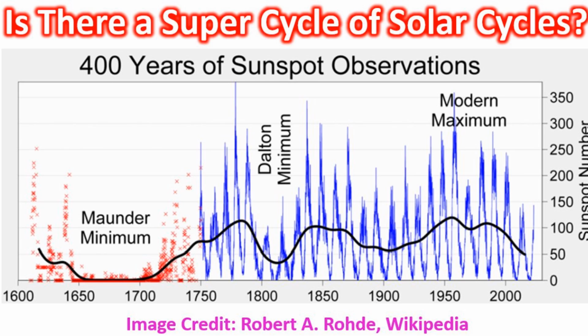Though 807 tubes were fully rated for up to 60 MHz, as my home Philips Prestige radio, which I had used as RX, did not have the 20 meter band, I had operated mostly on 40 meter. When the solar cycle went down and 40 meter propagation came down, I had made an additional tuning coil for 80 meter and worked a few VU stations on 80 meter, mostly on CW. For the same reason, I could not experiment on 21 MHz and 28 MHz in those days. Moreover, the lack of a good communications receiver prevented me from activities on higher bands.